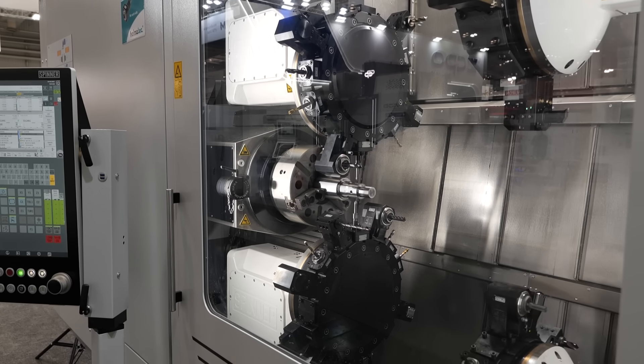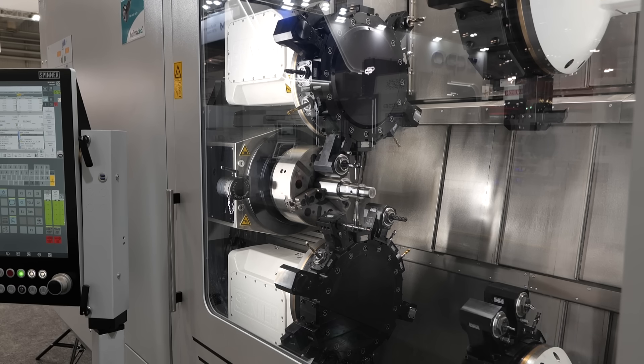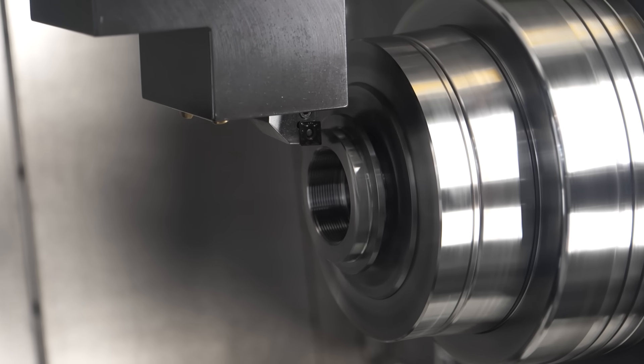So we can do things like pinch turning? Yes, for shaft-type operations you can turn with the up and down turret simultaneously on both sides. You can use one turret as a tailstock, or you can have a steady rest to support a shaft-type workpiece.